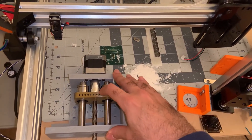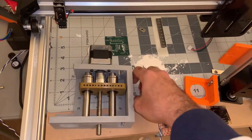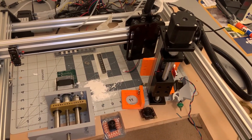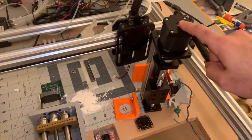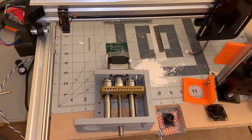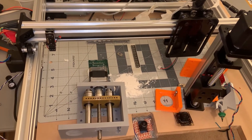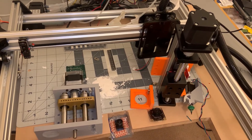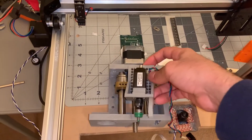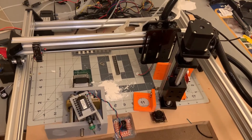The only issue I see is that this thing moves a little bit — it's not too bad. There's also a camera here for this assembly, but I eventually decided to go with something stronger and more stable. This part can actually bend if you press on it. I don't think it'll be a big issue, but I don't like anything that moves, especially on the head, because pick-and-place needs to be as accurate as possible at all times — otherwise you run into weird issues in the middle of a job.